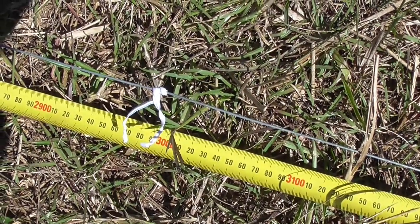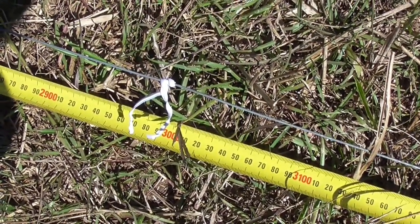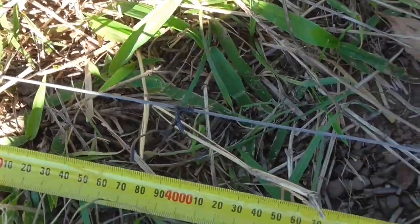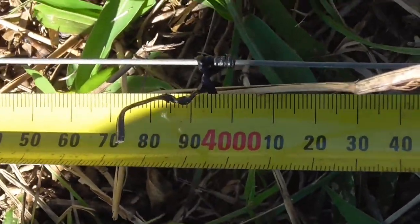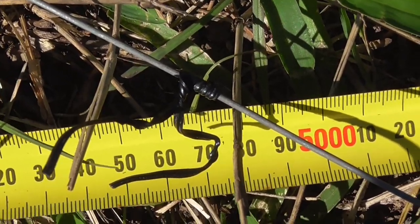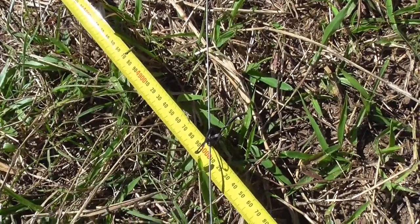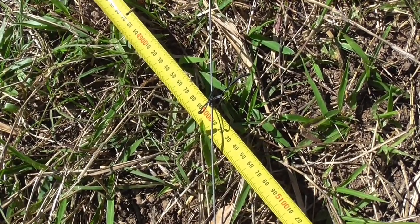All I've done is established one corner of the building exactly at 90 degrees. You can peg out the rest of the building with wire and measure corner to corner to check, but I'm not going to do that because I have faith it will be fine. Here the side of the shed measures 4 metres. When I measured across it read 4 metres 970, which was wrong. I adjusted the end and redrove the peg, and now it measures exactly 5 metres — so it is now 90 degrees.